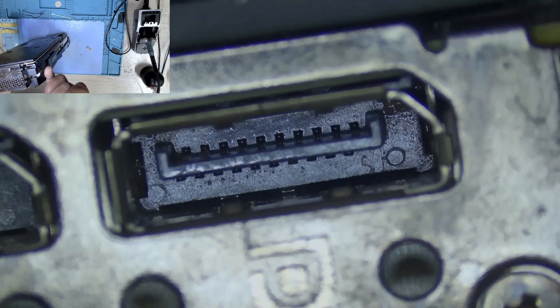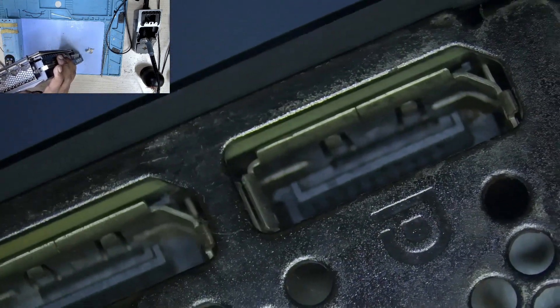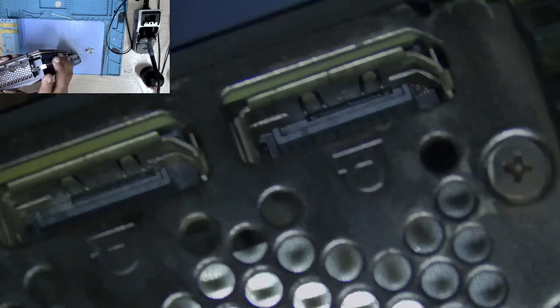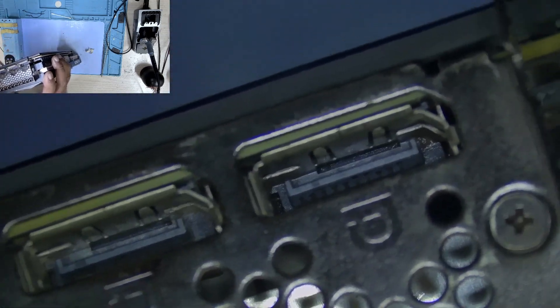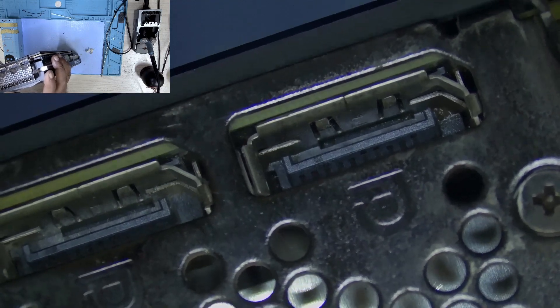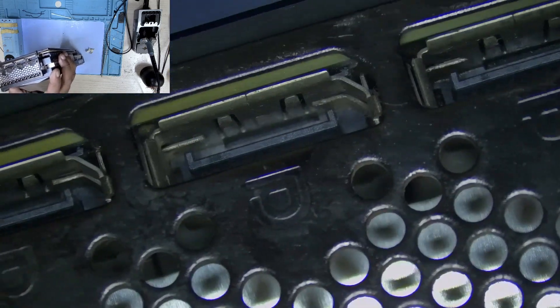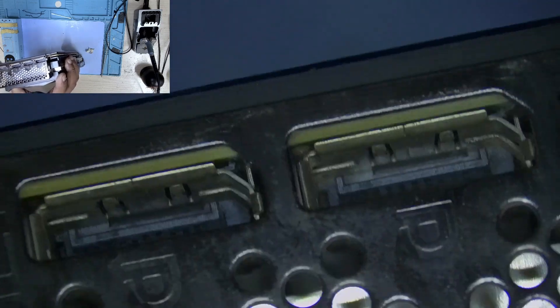You can see it's much cleaner now. Sometimes what you see is a lot of oxidation that forms on those pads because these cards are used in environments with air conditioning — they oxidize and because of that they don't make proper contact.